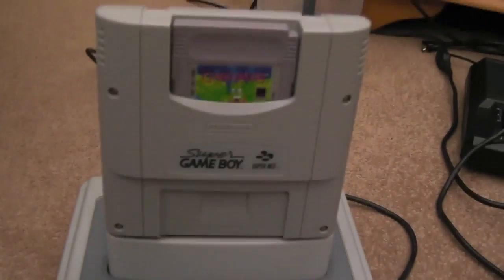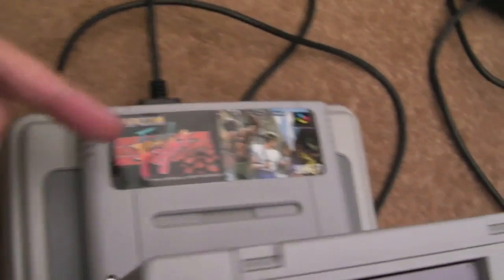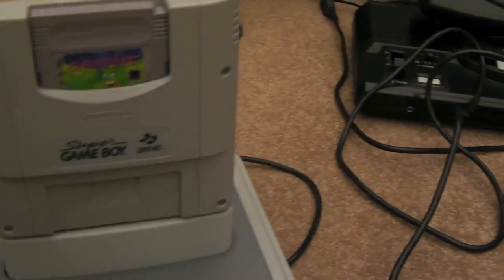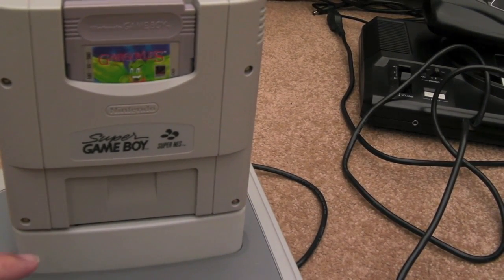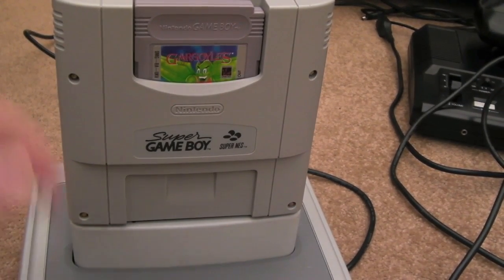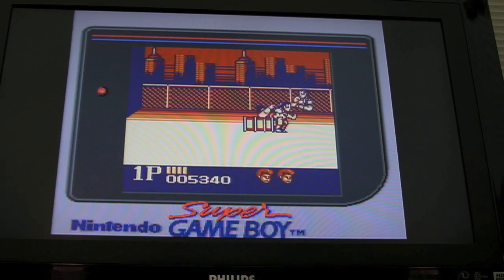Now you can see the way I'm doing this at the moment. I've got this tower here where I'm using the adapter to use a SAC, Japanese CIC. So my first thought was that it was something to do with it, but I don't think so, because the CIC is just a pass-through. I think there's something wrong with the actual DMA side of this. I think it's trying to pull the sound across, and there's no sound being generated, and I think that's what's going on. I think the caps on here need swapping out. So yeah, I'm going to take it back to bits again, and I think I'm just going to put some miniature electrolytics in place of those SMDs. So as you can see here, I've got it working.